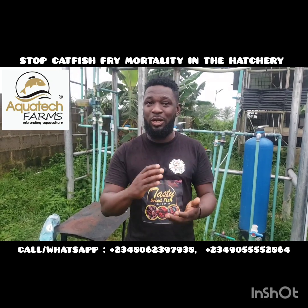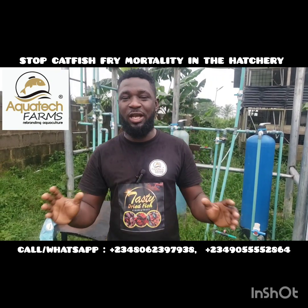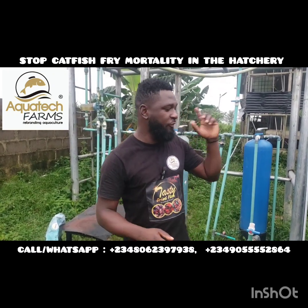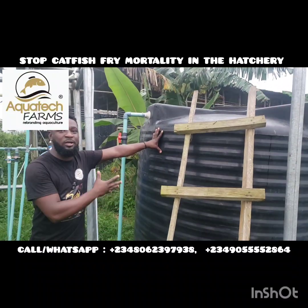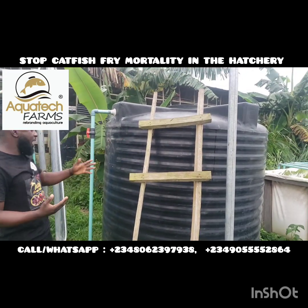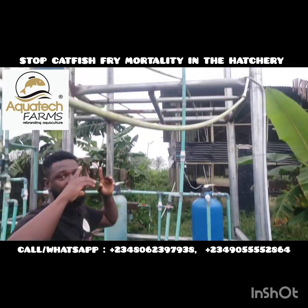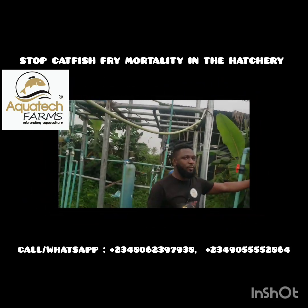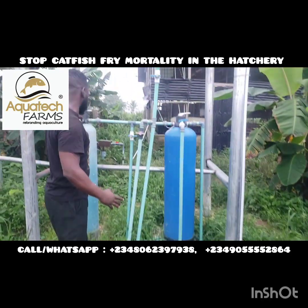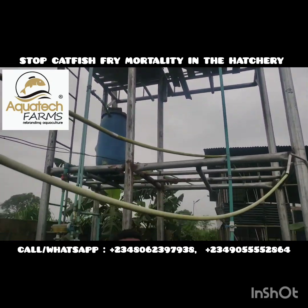The best method that is reliable, ideal, and result-oriented is erecting a standard treatment plant for the hatchery. What do you need to get this done to combat the issue of fry mortality within the first two weeks of production? Firstly, you need what we call a base tank — a 4,000-liter or 3,000-liter storage tank, depending on the capacity of the hatchery. You also need a surface pump, cylinders, and of course your overhead tank that serves the hatchery. Your water from the borehole goes directly into the base tank, then gets pumped through the treatment plant cylinders, and from the cylinders the water moves up to the storage tank, which then supplies the hatchery.